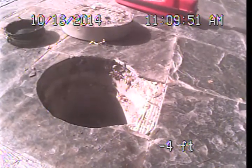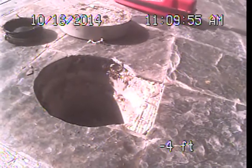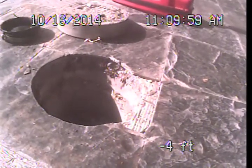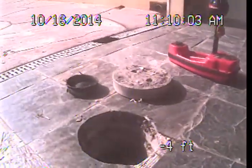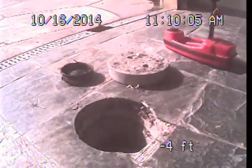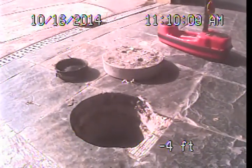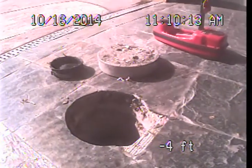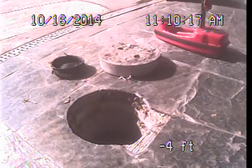I'm here at 1050 Stradella Rd in Los Angeles, and I'm preparing to perform a video examination of the main sewer line for Scott Schwartz. Now, the main sewer line is the portion of the waste drainage piping that is exterior to the structure. It lies underground and connects the building drain line system to the public sewer. The building drain line system then is the portion or portions of the waste drainage piping that would be underneath or interior to the structure.